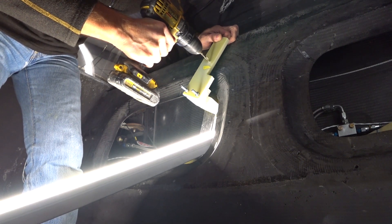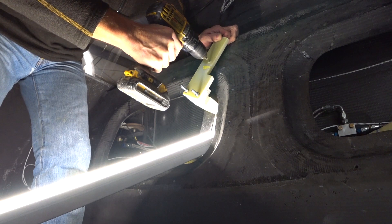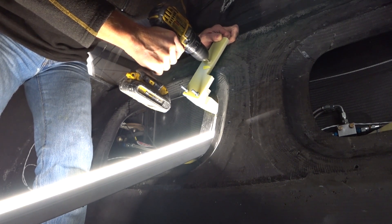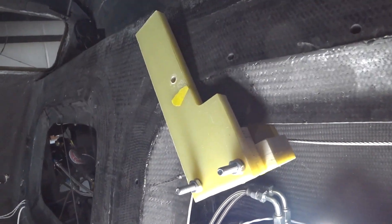The bulkhead has a one-inch core, so I'm going through carbon fiber, then one inch of foam, then more carbon fiber, and then there's a carbon fiber backer plate with all the nut plates for the door bolts. So I've gone through three layers of carbon fiber, each about 80 thousandths. Looking behind there you can see the drill bit tip in line with the bolt — that was the goal. Now I've got a matched hole through there. I can remove the jig and take my long drill bit and drill all the way through the brackets and into the back bulkhead, which is basically the main spar — all kinds of layers of carbon fiber going through there.